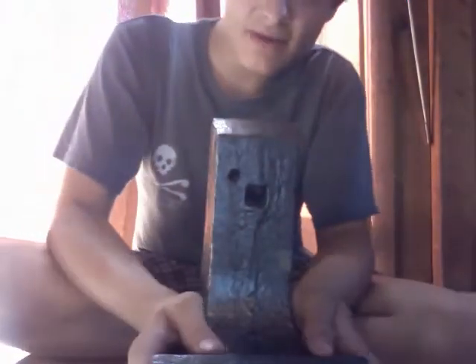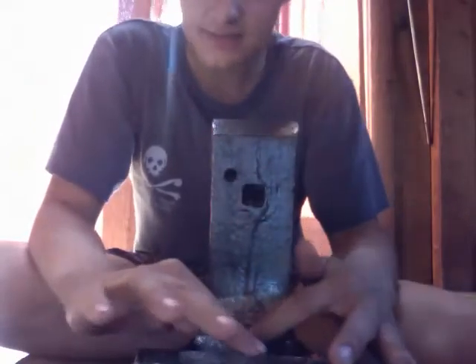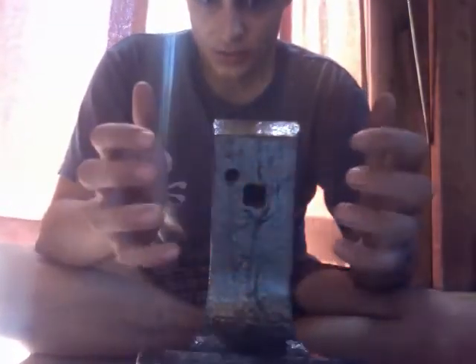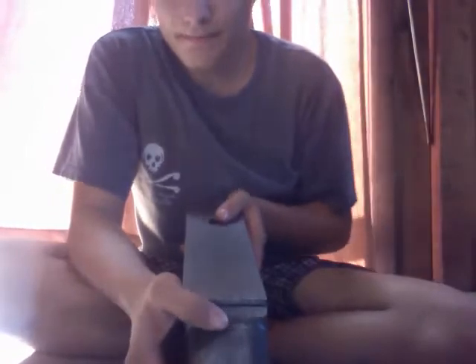You can actually see the line where it's been cast. This really doesn't have much of an impact, but if they ever say it's forged or drop forged and you see this line here, that means it hasn't been forged — it was cast. This line is where two pieces of the mold, called the cope and the drag, met. The cope is the top half and the drag is the bottom. Where they meet, there's usually a line where the liquid steel flowed out. They did a decent job machining it off — there's no line on the face, horn, or step — however, you can also see the line along the bottom.